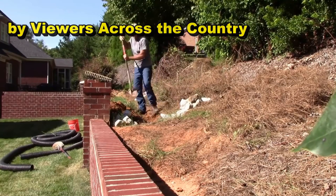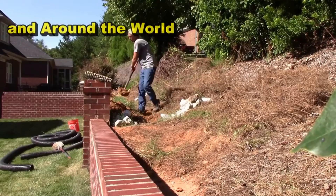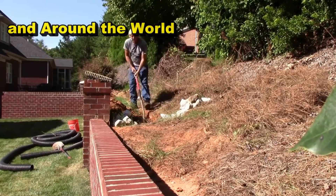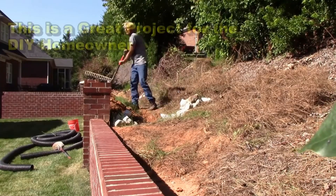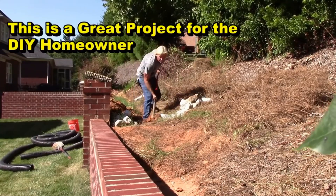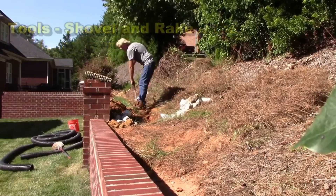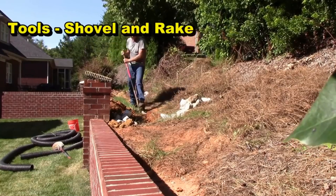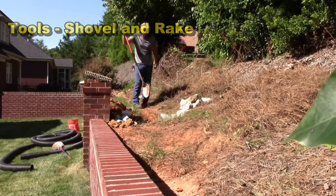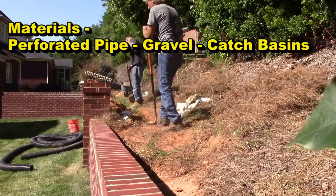What we need to do is make an open French drain — a trench drain — and basically this is just gravel perforated pipe. We always add catch basins; that's very important to pick up even more surface water. It'll discharge back into that 18 by 18 storm drain which leads out to the front. Give water a place to go and it will go there — it's really that easy. We're installing four large 12 by 12 catch basins, and the water will drop into each basin.